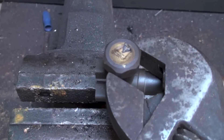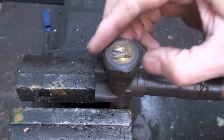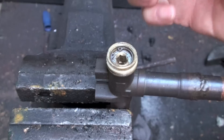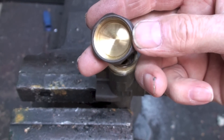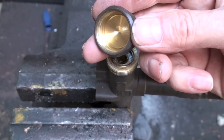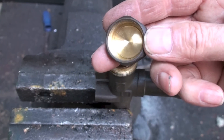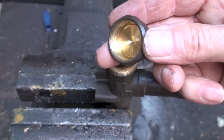Here we're looking down at the top. Pull this cap off — this cap should not be really tight. It says turn it one-sixth of a turn once it contacts. This part is not a sealing cap. Many people have tried to make this into a sealing cap, put O-rings in it, put pipe dope on it. I just don't think it works. It usually works for a little while and then it blows loose.